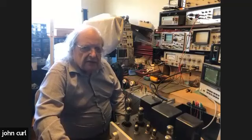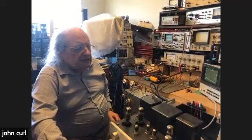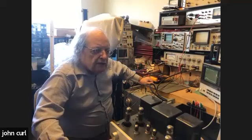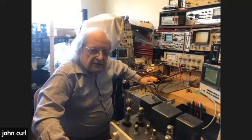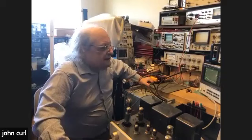So one volt in will give you, let's say, 10 milliamps out, or one volt in will give you 100 milliamps out. The difference, that is what's called the transconductance of the tube. Now, as the tubes age, they lose their transconductance. It just wastes away, wears away, I'd say. And that's one of the reasons that weak tubes often sound so much better when you place new tubes in, that they say, oh, wow, it's perky now. It's not sloggy. Well, that's because the transconductance is up.